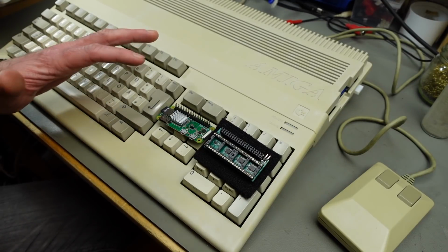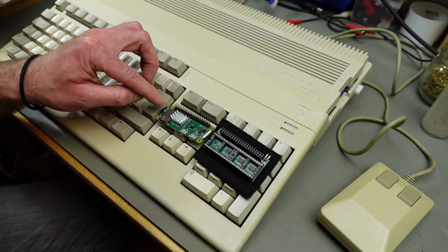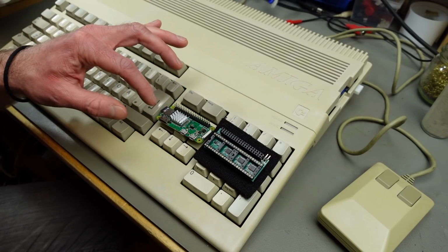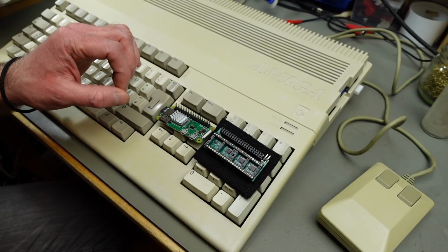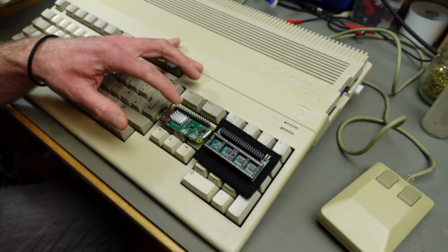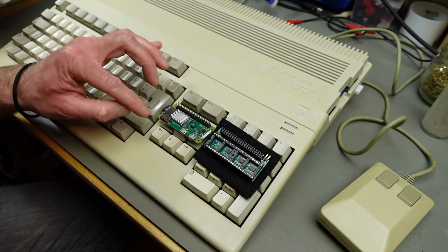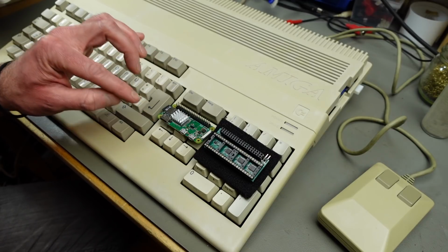It is a bare metal software, so it just boots from the microSD and runs without any operating system, so it's self-contained software, which makes it really fast. And it's directly communicating with the processor and the graphics output circuitry that's in here to have very little lag.